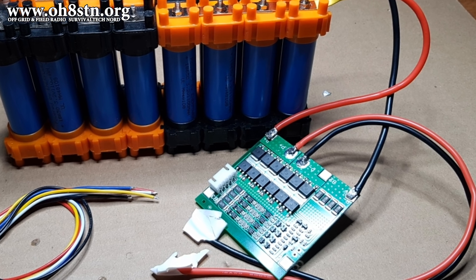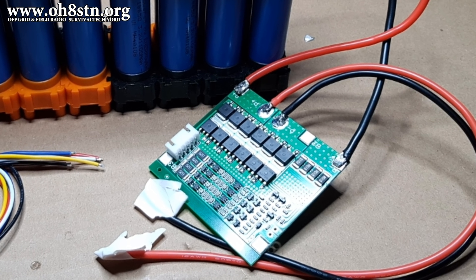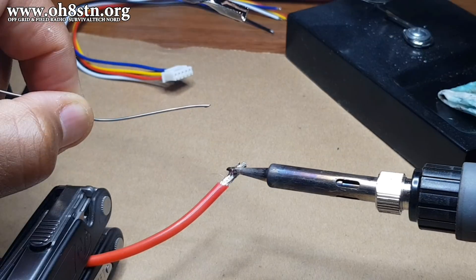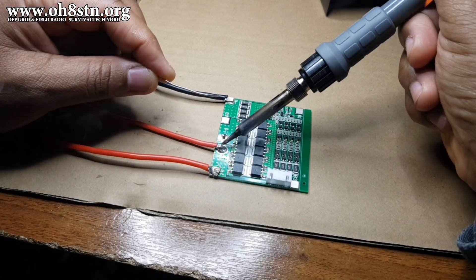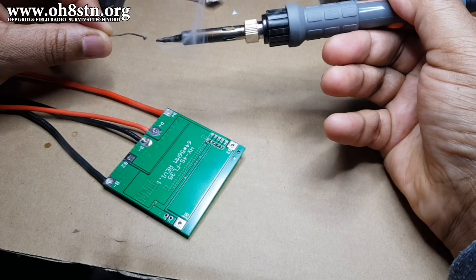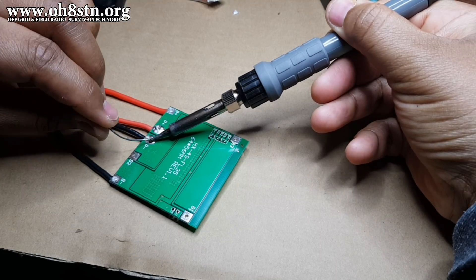There are so many different combinations for potential BMS boards and charge controllers that I have no way to know which one you're using. I decided on using one from eBay on this build — it's easy to obtain and easy to set up. The specs say it's rated for 20 amps; I wouldn't run it at 20 amps for long periods of time, but it does balance the cells and has been solid so far. I wouldn't trust this budget option to protect my Headway cells, but for these cheap 18650s, why not? You'll find a link in the description.